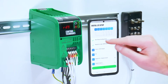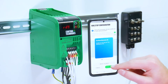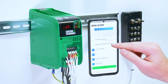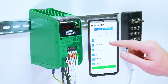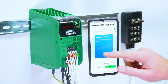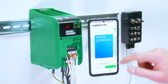You then have access to the digital inputs where you can edit the run/stop configuration. This will quickly configure your digital inputs and you have a helpful wiring guide at the top of the screen to see the changes you are making. You can select negative logic, which will again update the wiring guide. For digital input 1 and digital input 5, you can select the type, whether digital input 1 will be an output or digital input 5 will be a frequency input. You can also select the functions of these terminals and the app will prompt you if there is a clash where two inputs have been set to the same function.